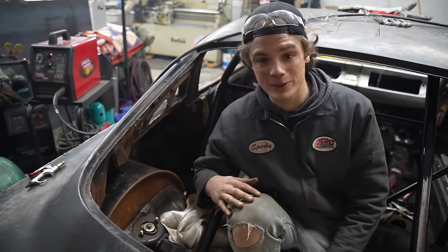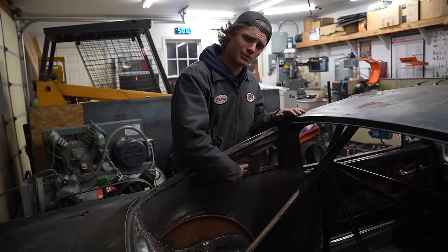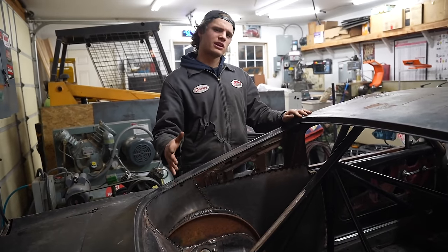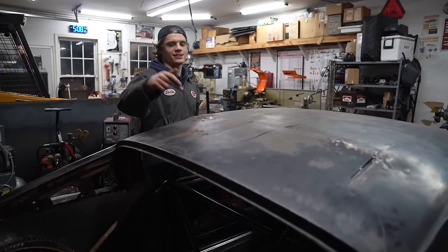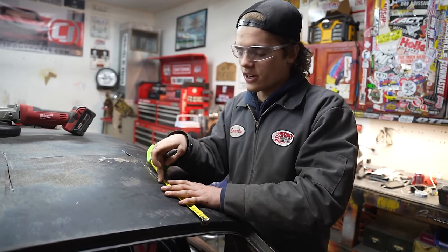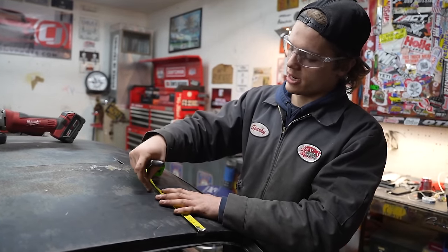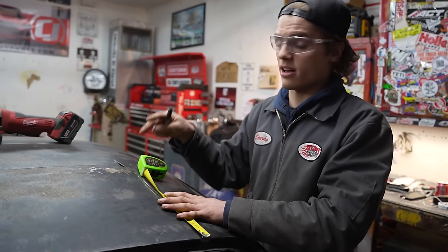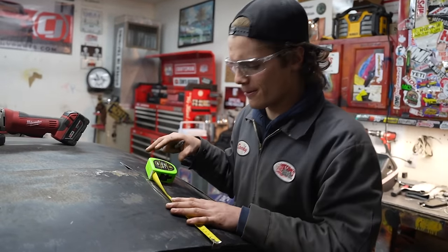This side came out a little bit cleaner and I banged it out quicker. Also filled in the gaps next to the wheel tubs. So it's time to move on to the last portion of fabrication needed before we can paint the entire interior — and that's roof scoops. I'm going to do some calculated guesstimations, finish off these cuts, make them all symmetrical, and then cut off the portions that have been hammered and rusted out to make some roof scoops out of fresh or patinaed metal from the old roof.